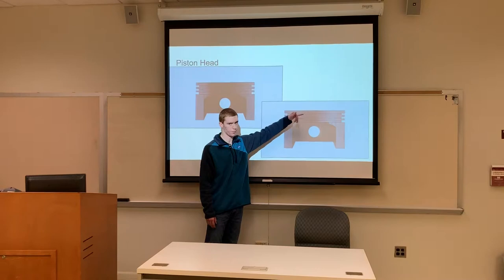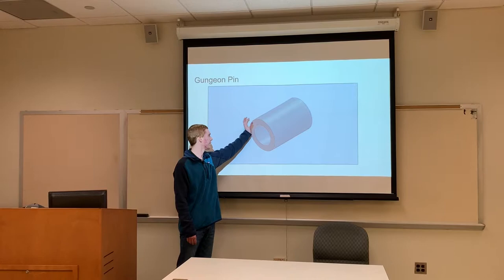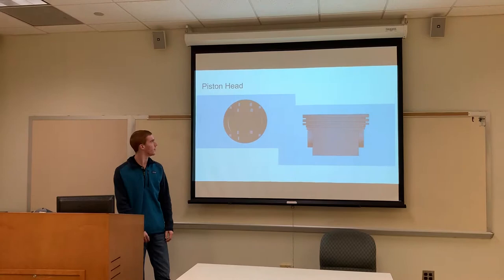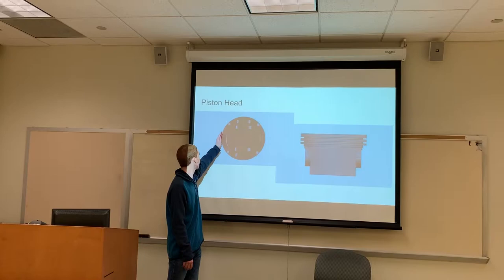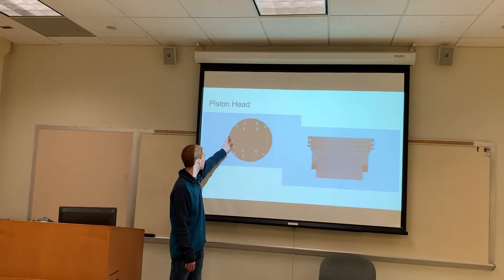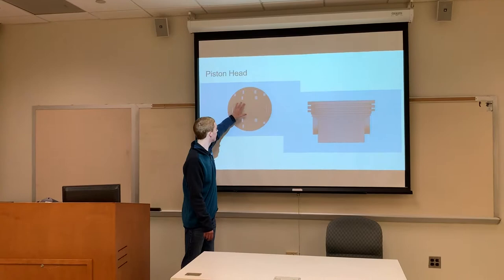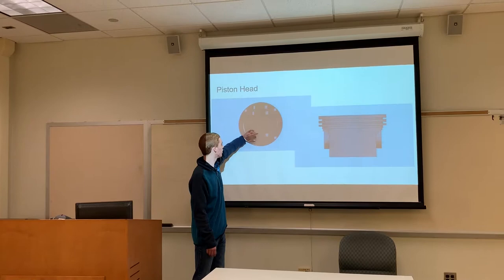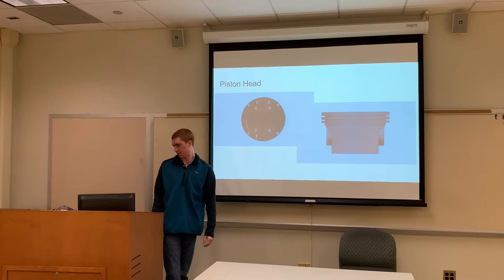This is my pin — I sketched it out and then revolved it. This is an underneath view. First I drew this extrude coming out right here, and then I extruded cut a little bit more in right here. Then I drew these two alongside the extrude that I already had and extruded those. And that's the side view of it — that's everything together. Next, Nathan.